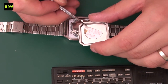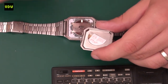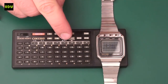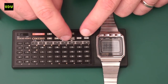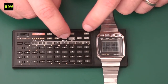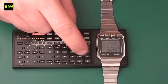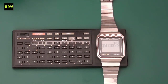One flaw with this watch is that it came without a spring, and part of the piezo ceramic speaker is broken exactly where the spring is supposed to make contact with it, so that's something I won't be able to repair. Now the moment of truth — we put it in transmit mode and see if the contrast gets lowered. And there we go: the transmission circuit is working just fine, I can increase and decrease the contrast. Thanks for watching this video and I'll see you on the next Vintage Digitals episode.